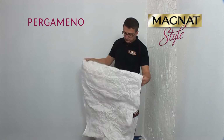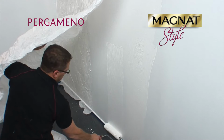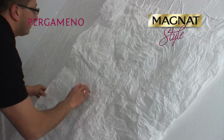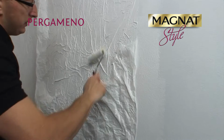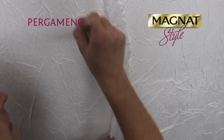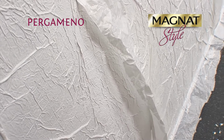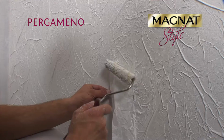Apply the successive paper sheets in the same way with the overlap technique. Wet coat the overlapping joints with the distemper by grading with a brush or a small roller. Another method of making the paper sheet joints is to sculpt veins in them by hand. All these techniques are to give a uniform plane without any joints visible in the finish.